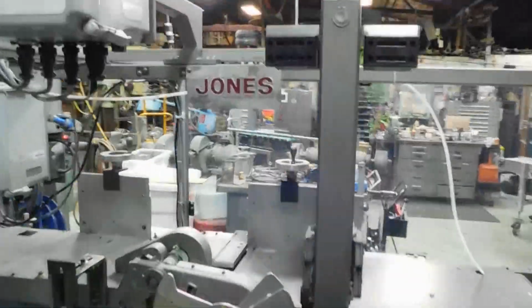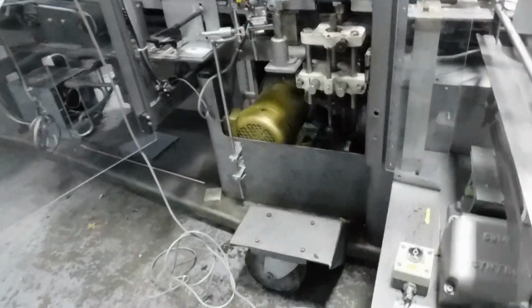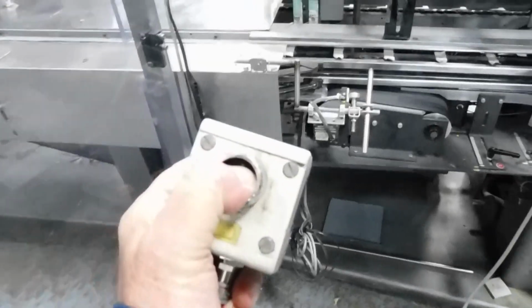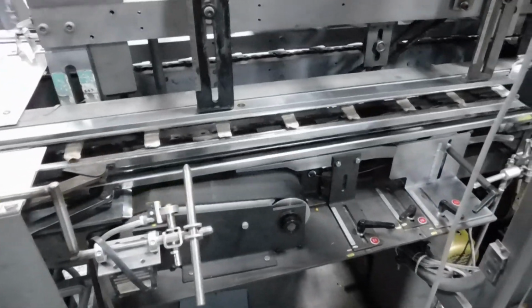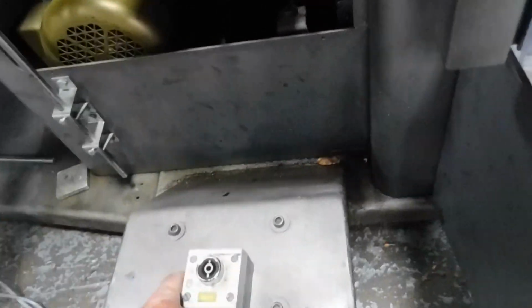along with, as you can see, all the guards, which have interconnected safeties for the doors. It has a remote jogging switch, which operates when the emergency stop right here is engaged. And you see I'm operating that here so that mechanics can go around and test the machine and operate as they're moving. Now when we put that down there for a second, here is the operator panel.